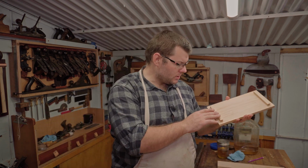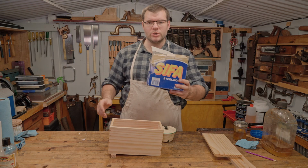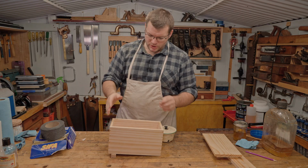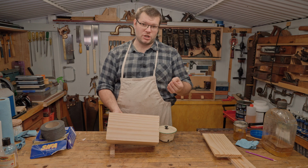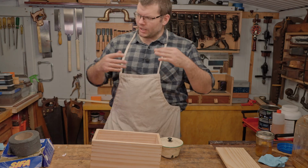So it's now dry. The lid is almost dry as well. I'll just start on the main body so you can see this process. Now, for this, what I use is 4/0 steel wool. So I just pull a piece off, wad it up like this. Now, what we want to do, now that this is dried, is this shellac is rough to the surface. It's a little bit rough in the hand. So we're going to be smoothing and evening out that surface.